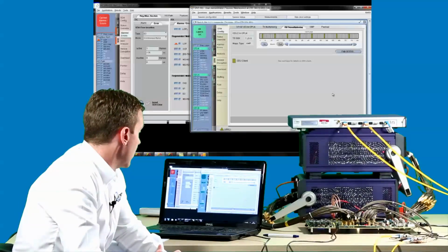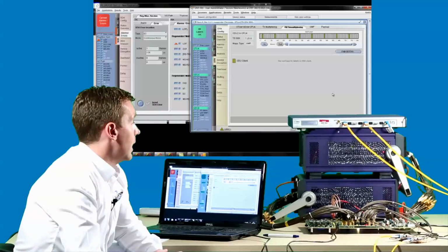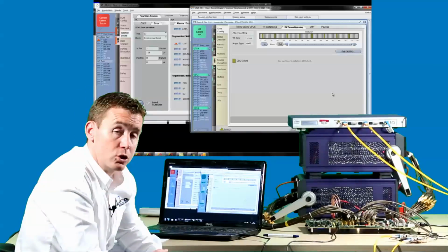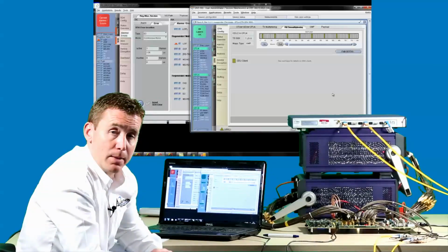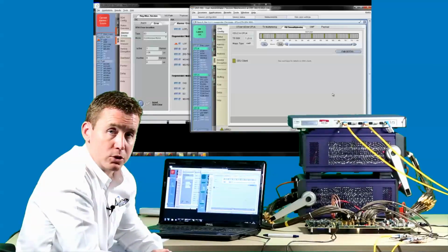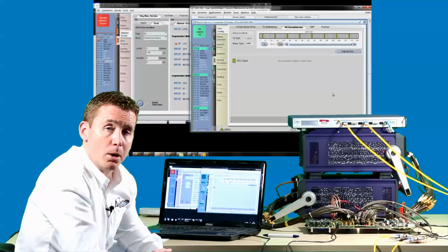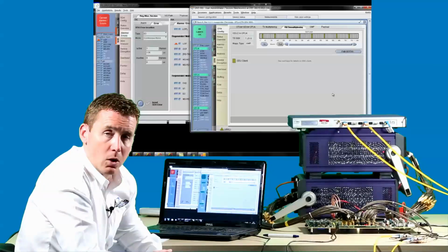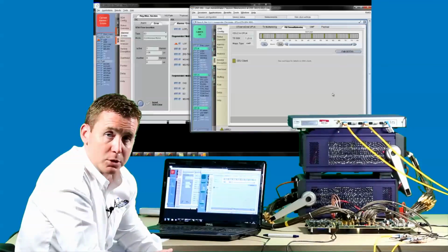Note that we do have some alarms on the 10 gig SDH tester, and that's because we only have 2 client signals. For the purpose of demonstration today, we've kept this simple and replicated those through. For a real world design, we would simply hook up more independently clocked transceivers and bring out the rest of those transmitted client signals.